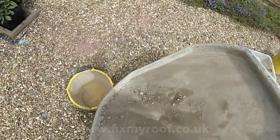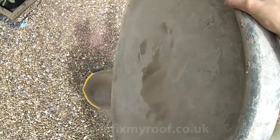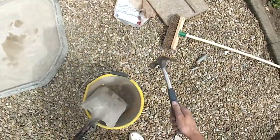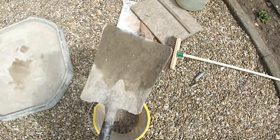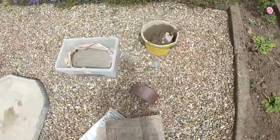Once all the main solids are loose, tip them into a bucket for disposal with all the other old mortar. This can then be disposed of as hardcore. Next, I give the shovel a light hammering straight into the same bucket, and because it's not wet or cured, the old compo simply chips off a treat — no need for water or scrubbing.